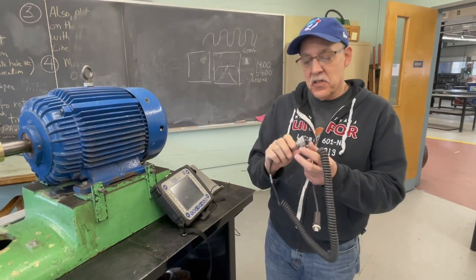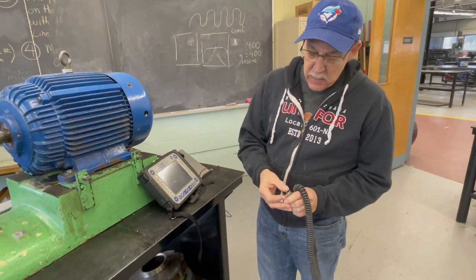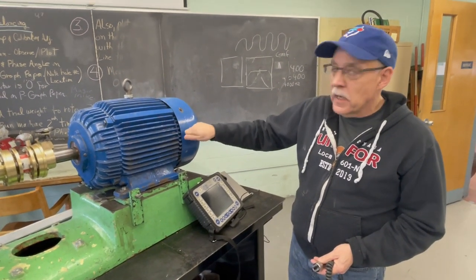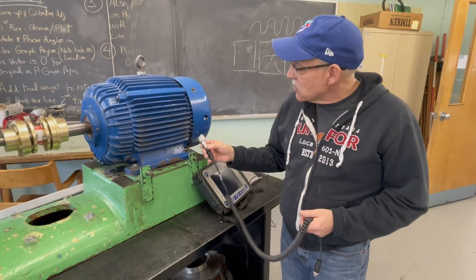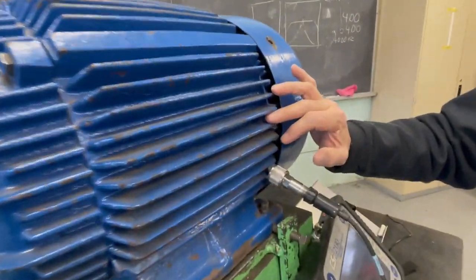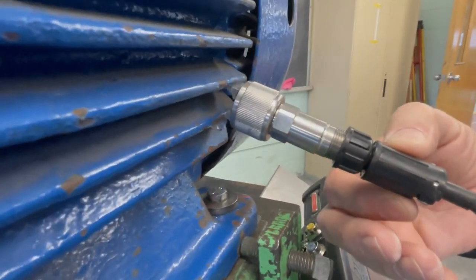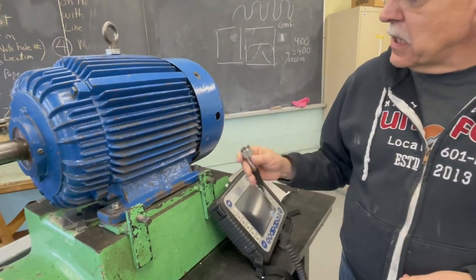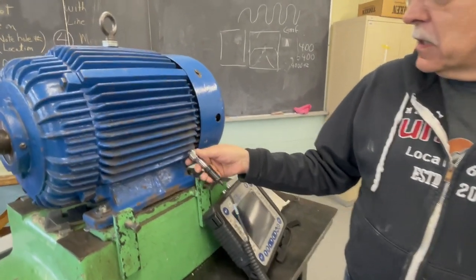This accelerometer is exactly like an egg — a very delicate, sensitive piece of equipment. First thing I do is clean the poles off with my hand, make sure they're nice and clean, then find a solid location on the equipment to take a reading. You never take a reading on a tinny shroud that vibrates. I take a reading across the veins here. You can also have targets glued in that you can use. I put the accelerometer on, shake it to make sure it's tight.